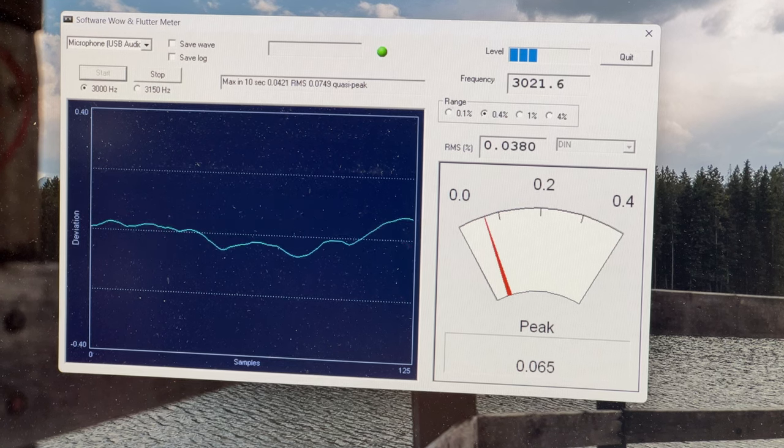Give me 1 second here. And the way I will service these contacts is the same way I did it for the Sony. I'm cutting out a piece of copy paper right now. Just gonna fold it lengthwise, like so. I'm gonna grab my acetone, if I can find it, dip the paper in the acetone, and I'm going to just grab these little contacts and one by one just run them over the acetone.